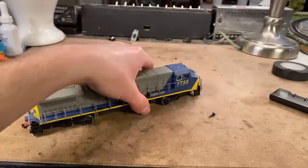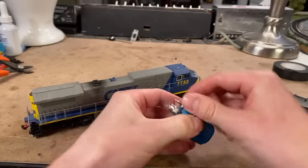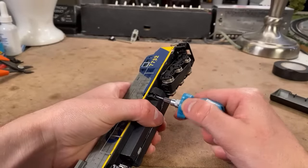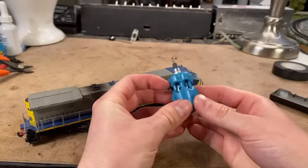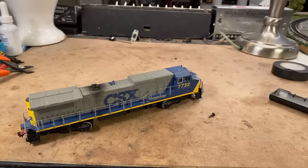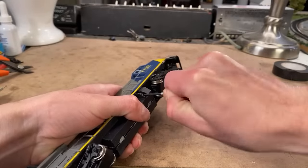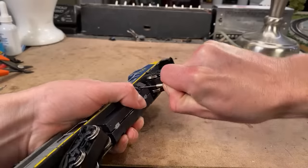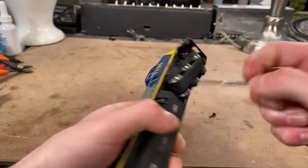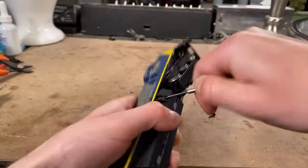Let me try a flathead. I don't find flatheads are usually the best way to get out a screw. I mean, you want to have as much contact area as possible, but I'll give it a try. What this really might need is a drill. That's too big. Is there a size smaller I can use on this? It would not appear so. See if this will work. Put a drop of oil on the screw, that might help it. If a flathead's what's needed to get this out, this might not be the right size.